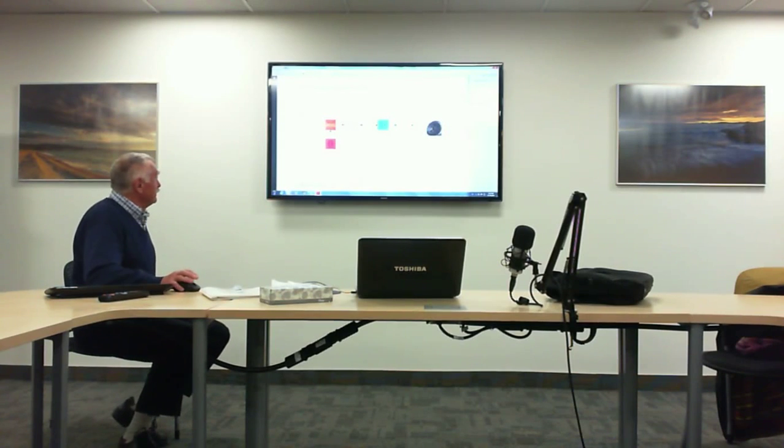First, we have a look at the block diagram of Major Armstrong's invention here. The superheterodyne radio starts with a radio frequency amplifier. Of course, the signal from the antenna is weak, and this stage would amplify the signal, would amplify the noise as well, would create some noise, but this is a low noise amplifier. Then the signal, so amplified, goes into the mixer. The schematic symbol of a mixer is either a circle with a cross in it or a square box with a cross in it.